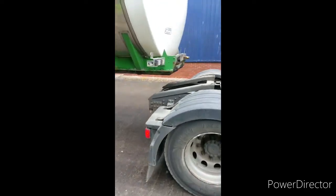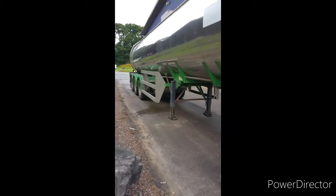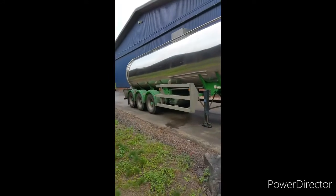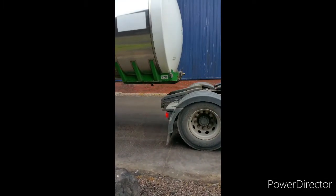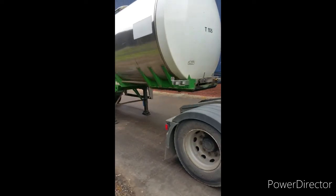I'm going to reverse back to where I should be. Also, just a point — look. If this trailer was dropped overnight and loaded overnight, it can quite often lose air pressure out of the airbags at the back, and the legs won't adjust. That can actually put the nose of the trailer a good bit higher. So you will need to adjust the suspension accordingly as well.